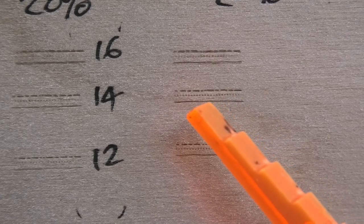It's not very dark. We can make it darker by two things. We can either reduce the speed, which will increase the exposure time, and I think that's the first move that we will make. And you can see a distinct difference now in the colour of the bottom line and the middle line. And look at the crispness of those black dots along the middle line. So it looks as though 14 is probably the best focus. But hey, we can't say that at the moment. We've got to try and find a slightly darker and better result.